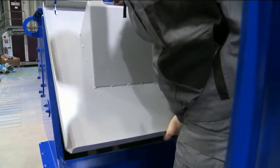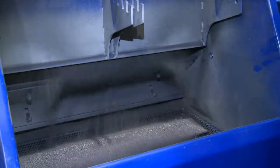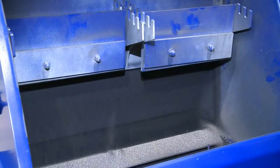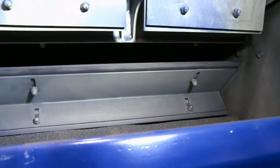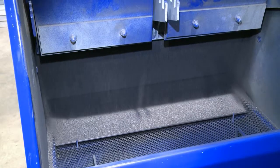The abrasive cleaning system operates on the principle of a cascaded air classifier. A self-regulating flap gate is used to create a uniform abrasive curtain across the entire width of the processing area. The contact pressure of the flap gate is set using counterweights. A stream of air generated by the filter unit's fan cleans the abrasive of dust and undersized shot. A special slider plate is used to make fine adjustments. If coarse material enters the abrasive processing loop, it is removed in the screening box.